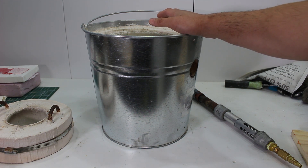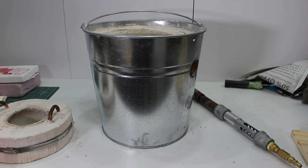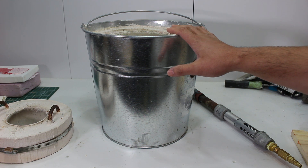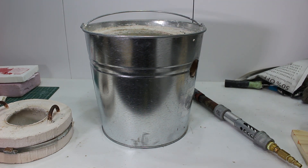I'm familiar building forges with proper refractory, but this is a DIY type of refractory that I've used in a coffee can forge on my channel. It's not really the best refractory, but I'll give you my impressions of it. This is just a galvanized bucket — you shouldn't use galvanization on anything that's going to get direct heat because the zinc will burn off, and that's not good for you.